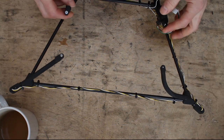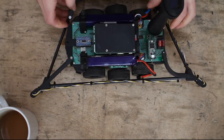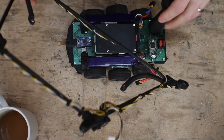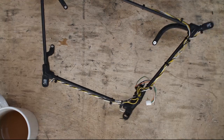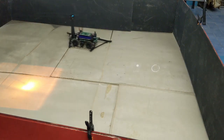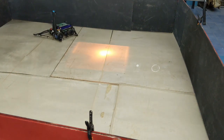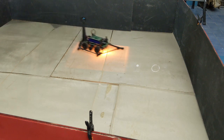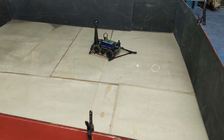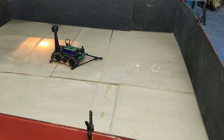This is our Minesweeper attachment. It allows us to add 4 brightness sensors to the corners of the robot. They allow us to pick up which panel of the floor is lit up. So the strategy is we drive as fast as possible around the course, and when we find a lit up square we stop. A slightly strange shape is to cover the widest track possible whilst turning on the course.